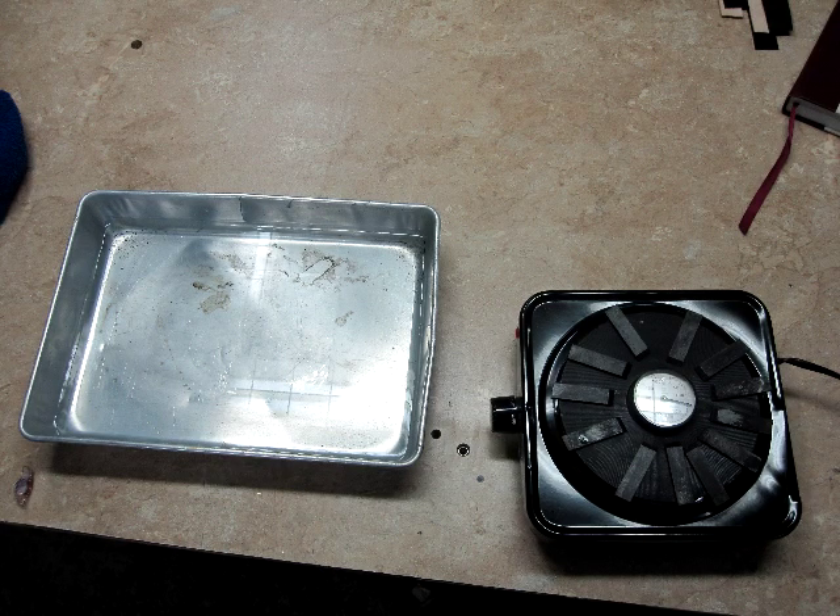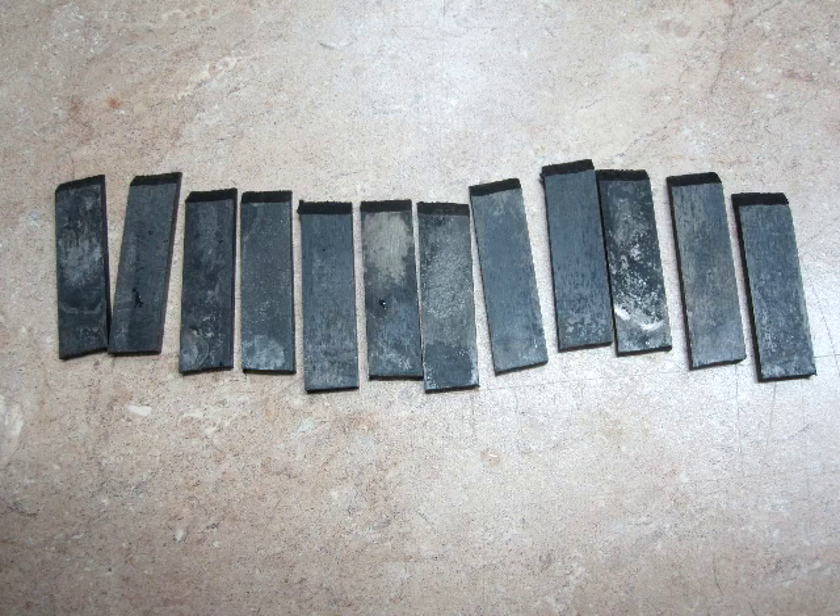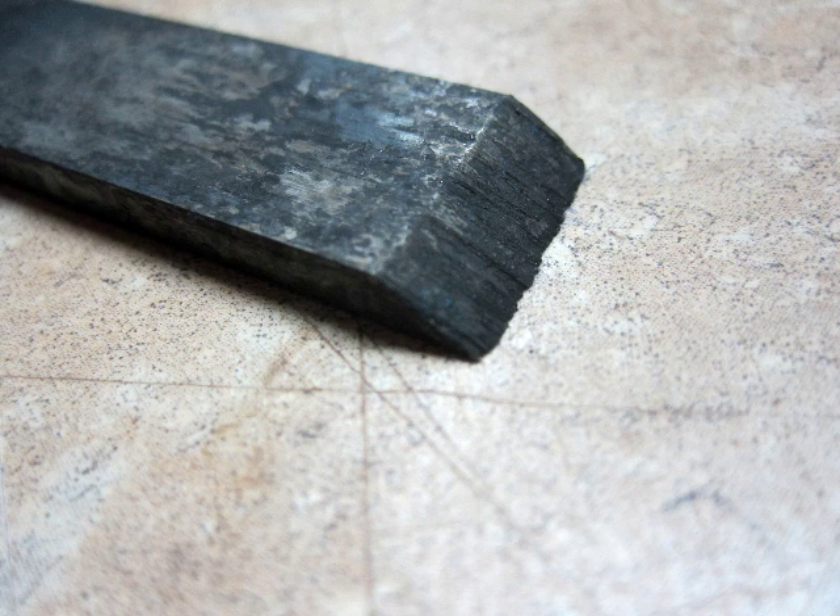After that I need to temper the steel. I've got a hot plate with a bucket of water, and I'll hold the blade blanks at about 450 degrees for a few minutes and quench them in water. Then what I have is a stack of blanks that are ready to go, though the condition on them is quite rough.